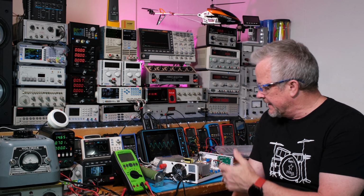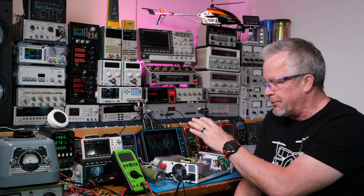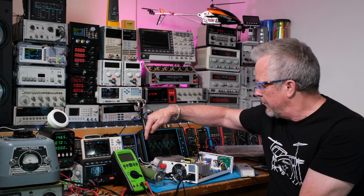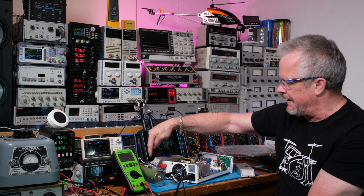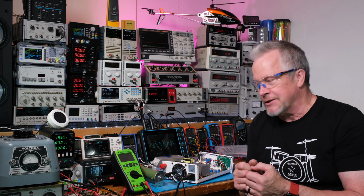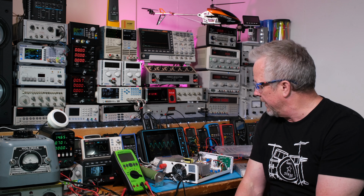Interesting, right? Seems like this guy will put out the power, 570 watts. I guess the real test would be to put the cover back on and get some more load. This long green one is a 300 watt load. These two 8 ohms that I have in parallel make 4 ohms, roughly the same. And also this 4 ohm, I think it's like 3.9. These two making 4 ohms are like 400 watts. Also, with those kinds of resistors the heating element's buried inside, so it takes a little while longer for the heat to get out.